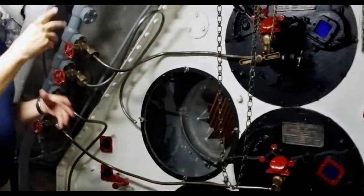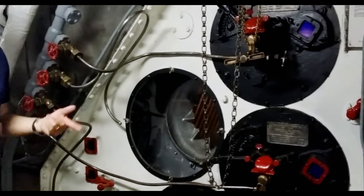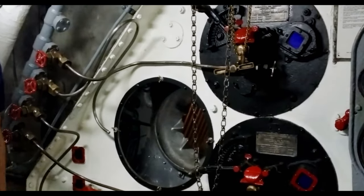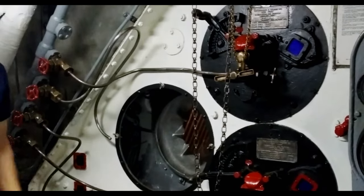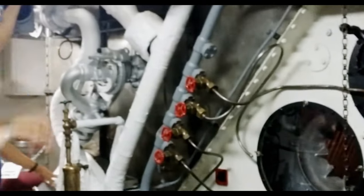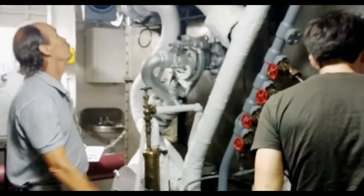Connected to this are a series of as many as 5,000 steel tubes that would heat the water. The water would be taken in by way of the distillation plants located throughout the ship. The drum down here is the mud drum, and the drum up there is the steam drum. The tubes go between the steam and mud drum.